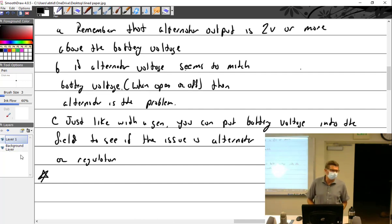And finally I said, well, the heck with it, I'll just take it in and have it overhauled. Now, of course, you have to have a boat alternator overhauled, because you can't run down to the parts store and pick up a boat alternator, because they're spark proof. Boats get fumes down in the belly, and if you have sparks, it blows up the boat.